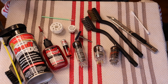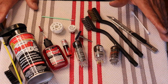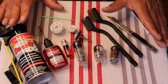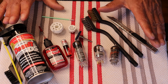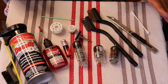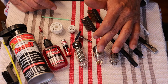So I think we've covered pretty much everything. When you clean your tubes, do it in a careful, logical way. Unplug your amp. Take your tubes out cold — you don't want to be working with hot tubes. Set yourself up on a nice big work area with a cloth that won't allow the tubes to easily roll around, and tackle one tube at a time.